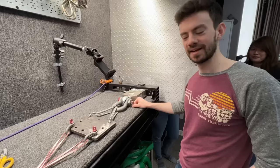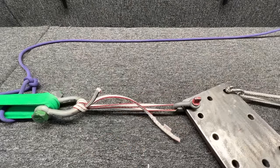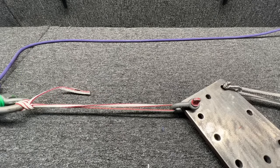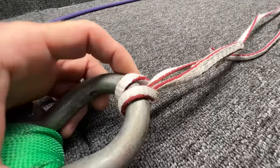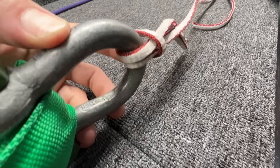Now we're gonna test the same thing but we're gonna gash one side and cut it and see how it fails. It's pulling through — look at that: 2.82 kN. That's kind of low. That's not a safety ratio you like to see. It's just how it cinches around this. I think the bigger bend radius allows it to slip easier.